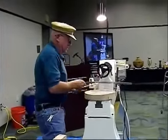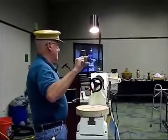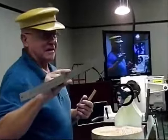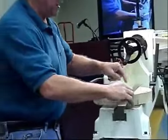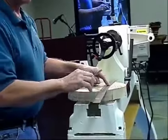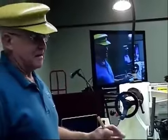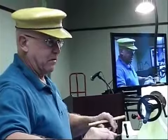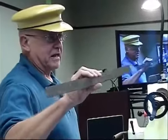The other thing I like to do, as we go along here, I'll point out some things. I really like this ruler. It starts in the middle. It really does work, because when you're laying out 2 legs, you put this right in the middle, and then count 2, 4, 6. 2, 4, 6. It's easy not to make a mistake. This really works out with hats, too, because you want to find out how far you go to this side, where the center is, and you can move it back and forth. I find this really works out good.